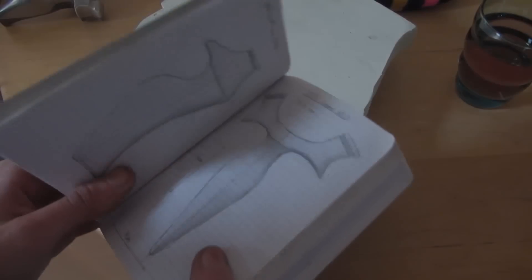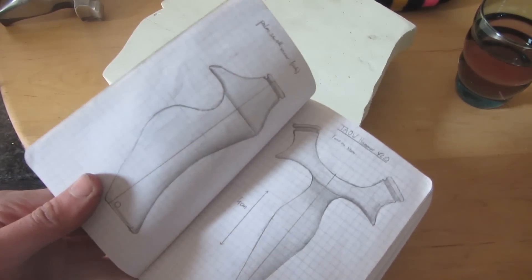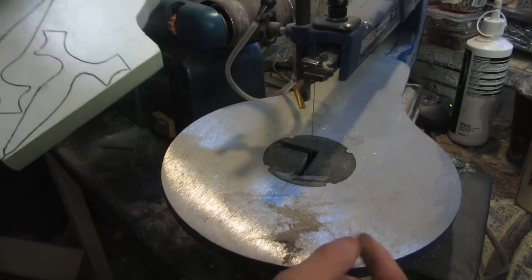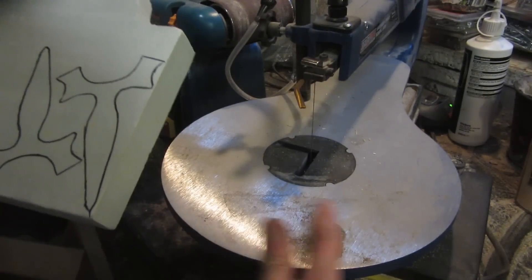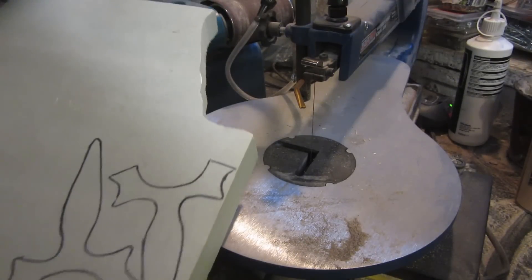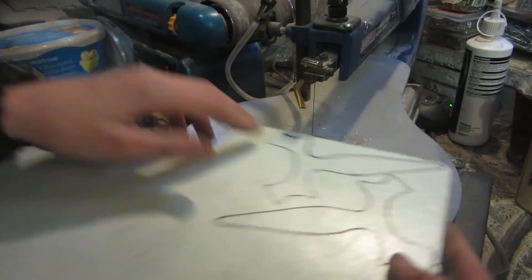Since this foam is not quite thick enough to make a full slingshot, I'm going to be cutting out my design twice and then laminating both layers together using a hot glue gun. The design I'm using is my Taohama design — the link will be in the description to my website where you can find it. For cutting out the foam I'm going to be using my scroll saw since it's got such a thin blade and cuts corners really well. Since foam is really soft you can pretty much cut it with anything, but most people suggest using a hot wire cutter. Since I don't have one, a scroll saw is the next best thing.